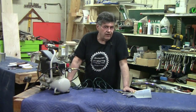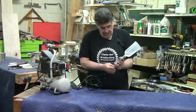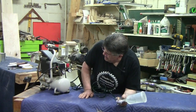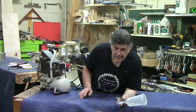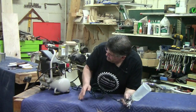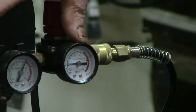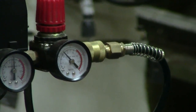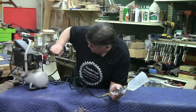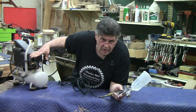40 pounds is a good range for a gravity-fed — 40 to 50 pounds, depending on what you're spraying. I'm adjusted to 40 pounds right here. That's 40 pounds at this regulator off the compressor. That doesn't necessarily mean I'm at 40 pounds at the gun, because I'm going through all this line. You may have to go to 50 pounds at the regulator to get 40 at the gun, if that's what you need.